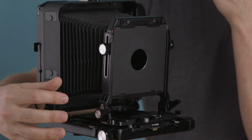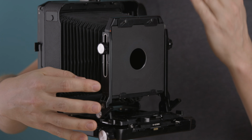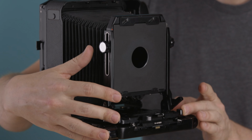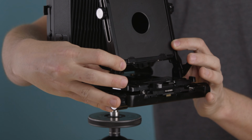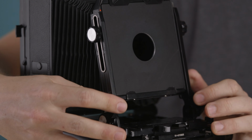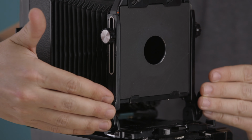As you can see here, basically this is the front base tilt. And when you want to go back, it locks at 90 degrees. So to unlock those, there are these two little side knobs or locks, which you push inwards, and now it will let you move it backwards. So that would mean you can tilt backwards if you need to. We're going to unlock, put it back to 90 degrees, and lock it again. So that's the base tilt.